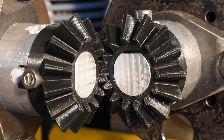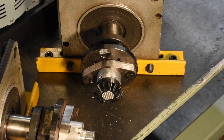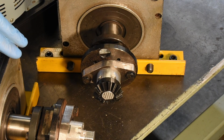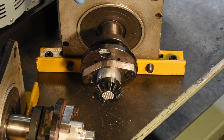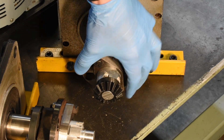The first test of each gear will always be friction since it's non-destructive, but before that the system needs to be calibrated. One of the most important parts about this system is the feedback I get from the servos, which I can use to measure exactly what's happening with the gears. Right now the motor is disabled, and this is just the friction from the motor — there's no current being fed into the motor to apply any torque.